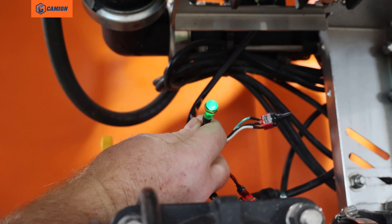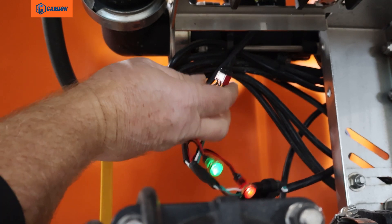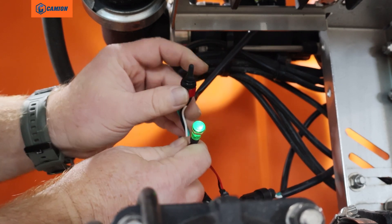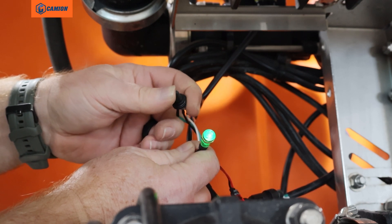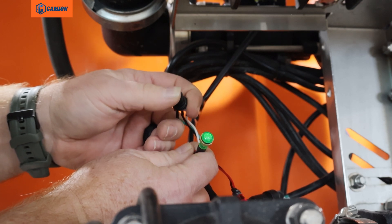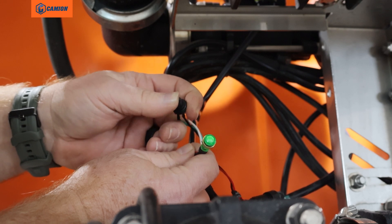The green light is lit up showing that the signal is connected. Take this little switch — here's your light — and click it. What that's doing is simulating a pulse through the flow meter. At this time your controller should be reading some kind of flow. The faster you click it, the more flow you're going to have.